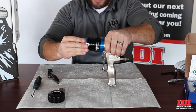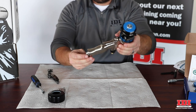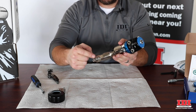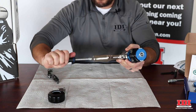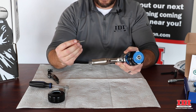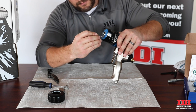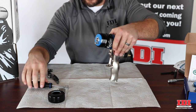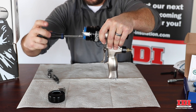There are really three levels: you can pull it off, you can use the screwdriver pry slots. The third option is this new tool that Graco includes with both the retrofit and the new gun — it's already installed down in the handle. Where the hex plug used to be, you take your 5/16th nut driver, and this is a screw in order to pull the cartridge off. In the worst-case scenario where you cannot get it out and it's gummed up, you put this in here, thread it in, and it pushes against the slot on the back and pries the cartridge out. Watch as I thread this in — you'll see the blue cartridge slowly start to pry itself out.